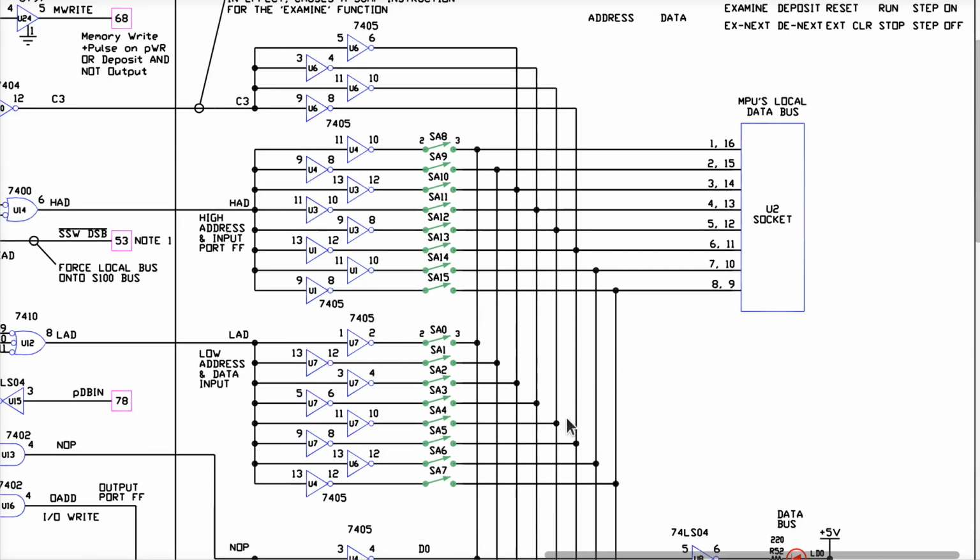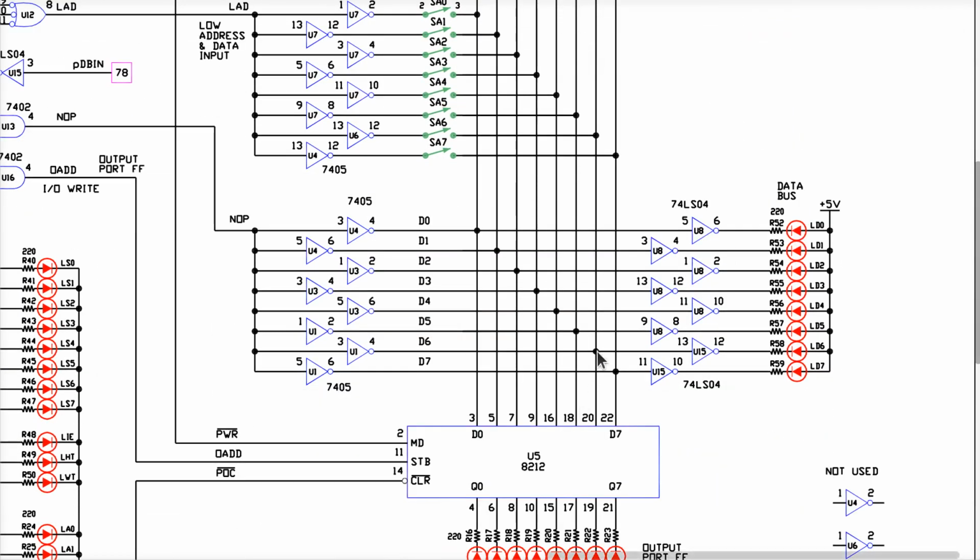These eight data lines include the one data bit right here, data bit 5, that doesn't work, all right? This is our problem right in here. So someone is preventing this signal from ever going high, okay, because maybe it's not connected to something that needs to pull it up, or it's connected to something else that's pulling it down and never letting it go. So let's look and see what it's connected to.